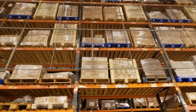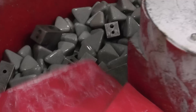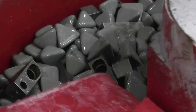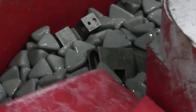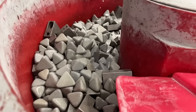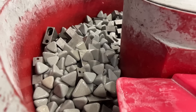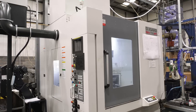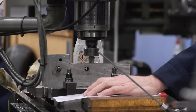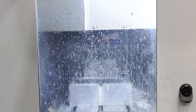Before the manufacture of a lock can begin, raw material is dropped into the holding area, which is then placed into the vibraball for deburring, so it's ready for the next process. The lock we are following is then machined in four stages on this twin pallet machine. Using jigs designed at Henry Squire, the blocks are machined, then rotated, machined, and rotated until complete.